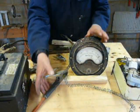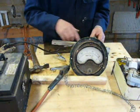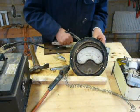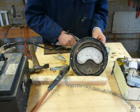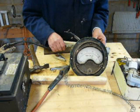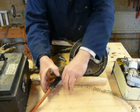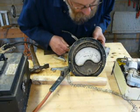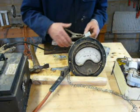Okay, so I suspect these are based on watts. So therefore, if that's 16 amps at 240 volts, that's basically 4 kilowatt. So therefore at 12 volts we're just into an enormous amount of current. We haven't got a contact there. Try that. There we go. What are we on? 50 amps, and it's still not tripped. There it went.